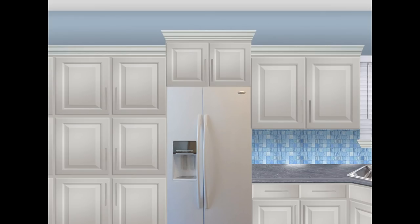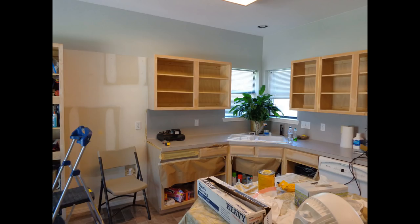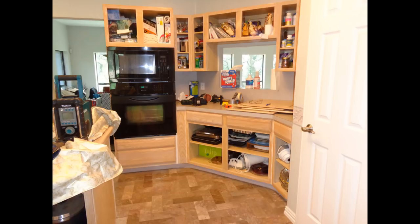I took some pictures of the kitchen and made a Photoshop mock-up of how I wanted the kitchen to look. We made a numbered cabinet door diagram chart, which we kept on the refrigerator door for easy reference. We started removing cabinet doors and numbering them according to the diagram chart. This procedure is important so you can install the cabinet doors to the correct cabinet when finished painting.